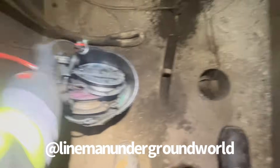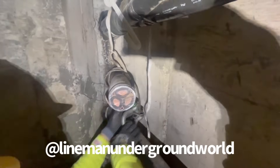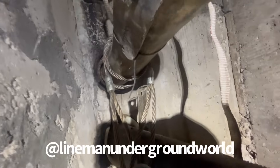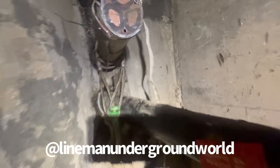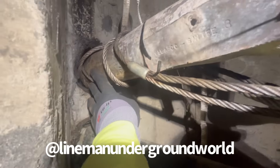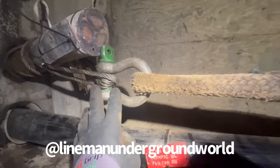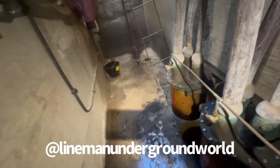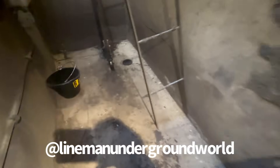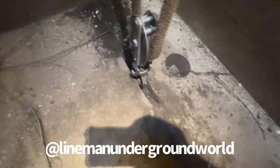Let's get that airplane sling in there. We're gonna try to shove it inside the conduit to grab it a little bit better. Always use your shackle, and we got a rope to the wall over there. Try to use your figure four if possible, and we have a beautiful anchor down here with our blocks, tied to the wall — stable, looks good.